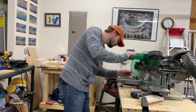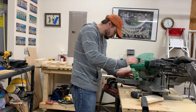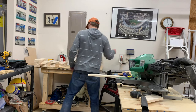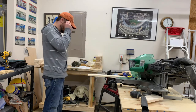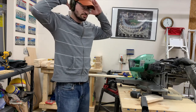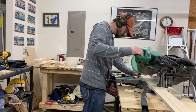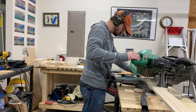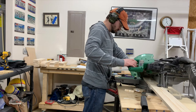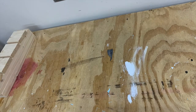Here I'm adjusting the saw to a 30 degree bevel now, using the same tool as before — so 30 from 90 is 60 degrees. I always unplug the saw when I'm working close to the blade or measuring things out, and then I put on my safety glasses and hearing protection. The 30 degree bevel is for the top of the tree — all the rest of the tree is at 25 degrees and the top is at 30 degrees.